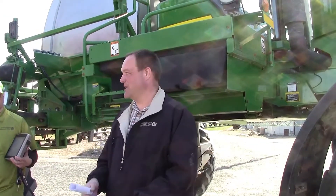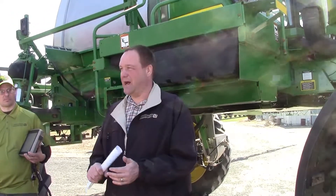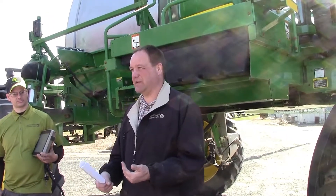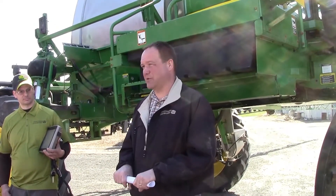You'd run alongside it and count how many turns that tire went so you know how far you went, and then you catch that amount of chemical and have to go through the conversion and figure out how many ounces an acre, gallons an acre you're putting on. Now we're doing it a little different — we're telling the computer this is how fast we're going and this is the amount of chemical we want to catch. We go out and do that, and now we're letting the computer figure out everything. Then if we're off on that, we enter the new numbers and it actually changes our flow meter calibration.